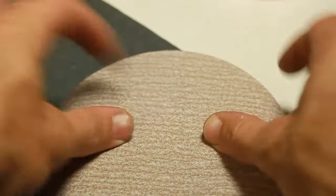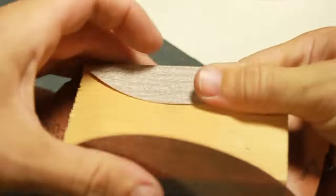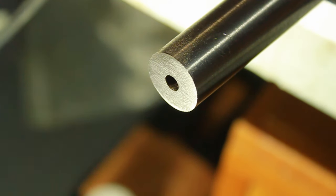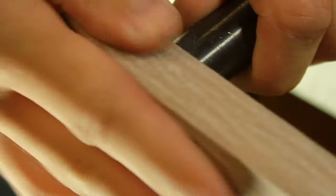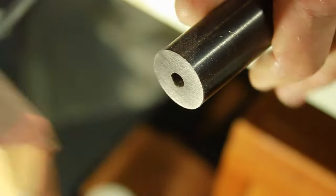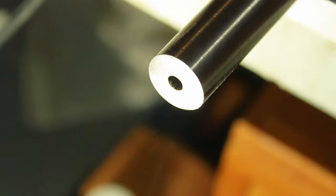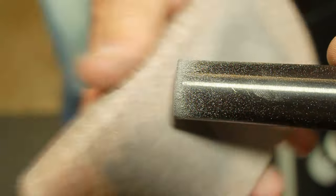Using a piece of board and 150 grit sandpaper, continue to block sand the barrel. This process is used to refine your finish on the face of the barrel. You will repeat this step with 400 grit sandpaper. Rotate the barrel along the way and continue to sand against the rim of the barrel to bring down the edge from the cut.